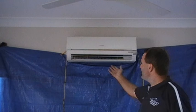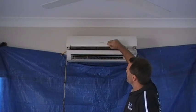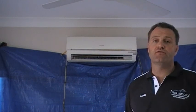per hour. Now, if we have a dirty fan barrel which sits under here, or dirty filters or coil which you have under there, it will reduce the amount of airflow that the unit has, thus reducing the capacity, which will make the unit run longer, harder, will wear out quicker, and will also have mold and bacteria being circulated through your room. And this is how we fix it.